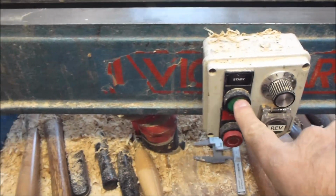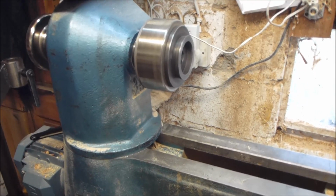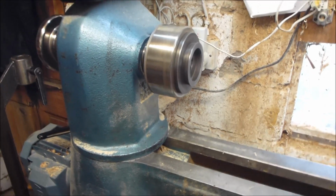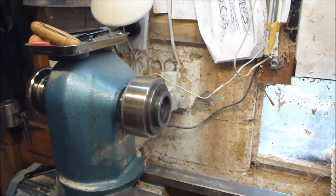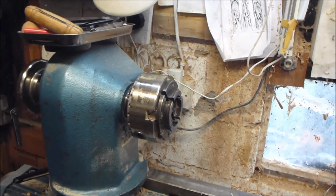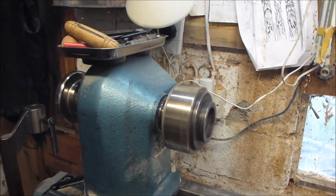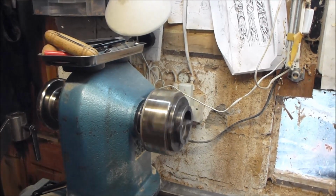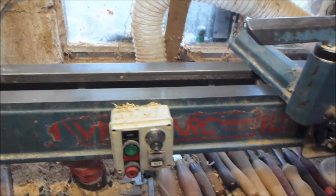It's all push button. Turn it on. When you're up to full speed, press stop. Press reverse, automatic reverse. Let's stop again, and it'll automatically go forward. Let's stop, and she just instantly stops. There's no waiting for it to run down. Reverse into stop, just instant. Straight up to full speed there, and straight into reverse from full speed. So that's the lathe.